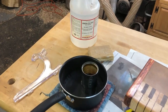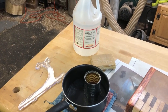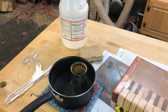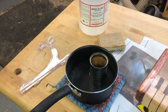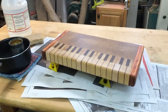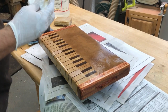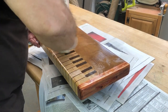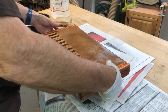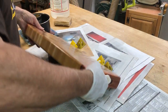So this section is two days later. I let that thoroughly dry. I used a soup can and some boiling water there. And I mixed mineral oil and beeswax in that can, and made that all so it's liquidy. Then I poured that and spread that all through the board, making a nice thick coating. This finish I got from the Wood Whisperer. And this is how he finishes his boards.